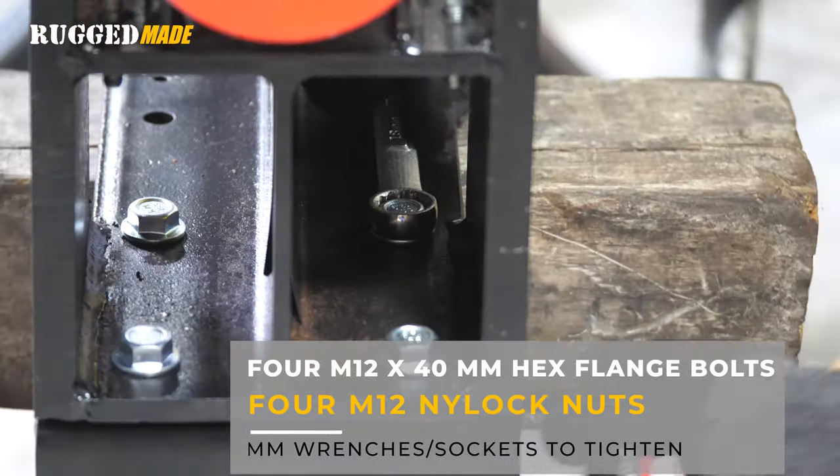Here we've got the larger of the two bores — three quarter inch for the engine side on this engine, and one inch on the larger engine. Here we've got our elastomer spider. Pull the spider out so we can see where the jaw coupler should end up — you basically want to start with it flush to the end of the shaft. Tighten down the set screw just snug for now to hold it in that position. Put the elastomer spider back in place and put the pump side jaw coupler in place, and now we're ready to mount this bracket to the engine.